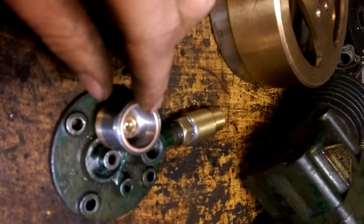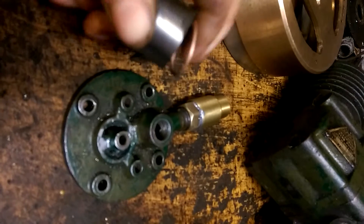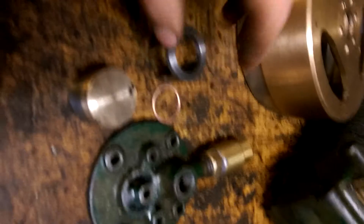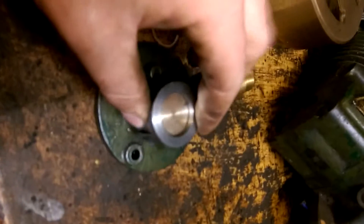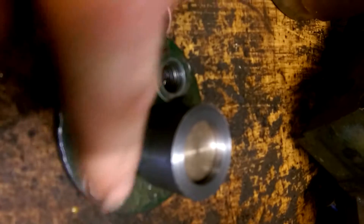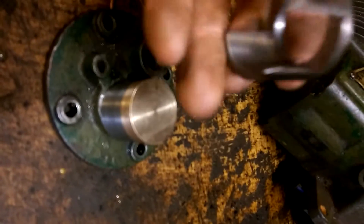At the bottom of the cage there's a little groove I've turned in which sits this copper washer. I'm going to put it on a friend's mill and just smooth it off so I can get a good seal with that copper washer. This then sits over the whole valve cage. I'm going to make a few little tabs — probably two funny-shaped ones — that pick up on those holes and weld onto the cage, so the whole thing is then clamped down with this bracket.